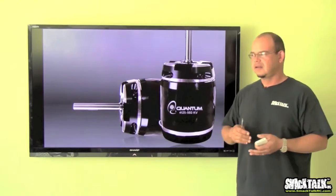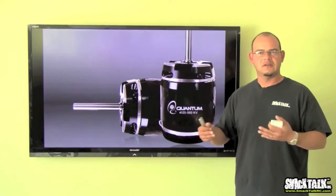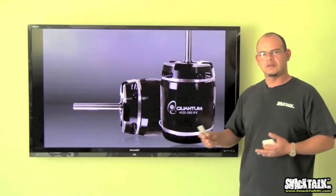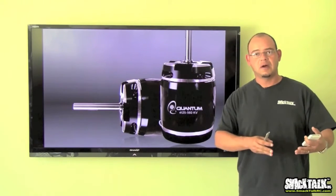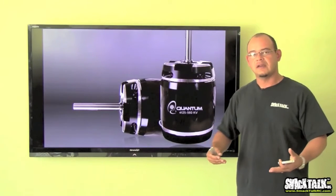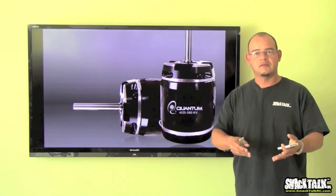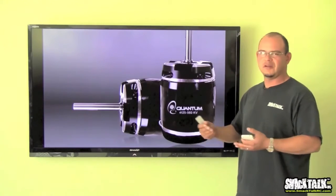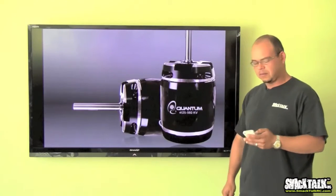So I've seen people that choose their own kV for their particular application, and of course there's other things you need to look for, like gearing, and we're going to talk about gearing towards the end of the episode. But kV is important. Try to go with the right kV so that you don't run into issues when trying to find the proper gearing. If you get a kV that's too high, you might not find the right gear ratio for that kV. So look at what the manufacturer of the particular helicopter you're trying to fly recommends for kV of a motor and go with that. Generally on 700 class electric helicopters, you want something between 450 and 530 kV or so. So that's an important consideration.